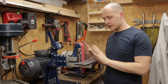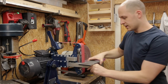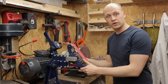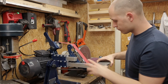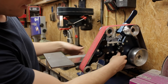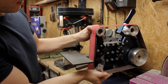This is the setting I'll probably have it in most of the time — with the backplate grinding surface straight like this. But you can also loosen a knob on this side to take the table off and adjust the angle. You can also tilt the table itself — for example, now you can cut 45 degrees. This knob over here locks that movement, and this other one adjusts the table height. And over here you have another knob to set this upright.